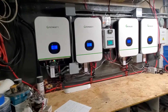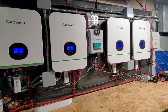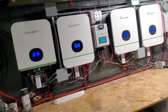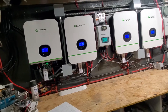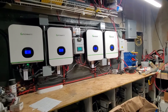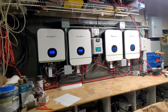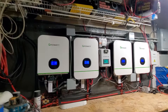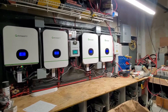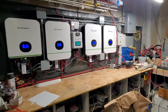I'm running 24 solar panels currently, rated at 465 watts each — though you never really get that much. By the numbers I'm at 11,160 watts of capacity. I've got 10 more to add, though I don't really need them because my average daily power coming into the house is about 24 kilowatt-hours. My lowest has been 19 and my highest was 37, about four days ago. We're pulling in enough power as it is, but I'd like more so that on overcast cloudy days we don't drop below average. They always say more is better.